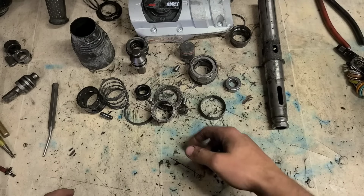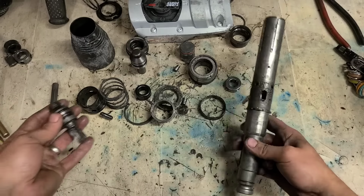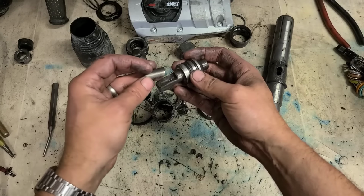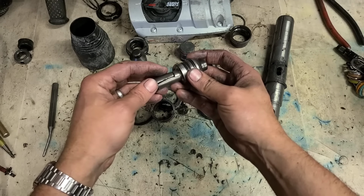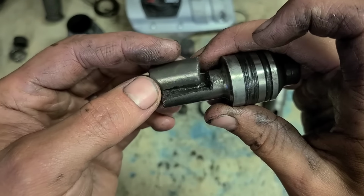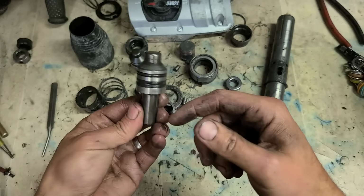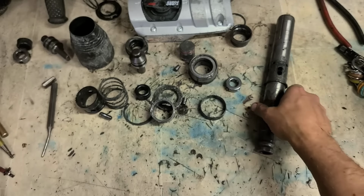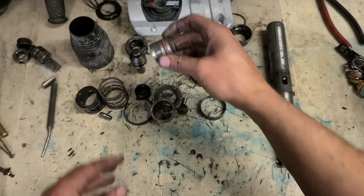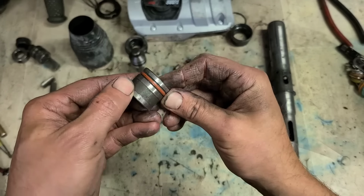Now, before we do anything else, I'm going to wash these parts out, because obviously if this broke inside of here, these hardened steel parts will have been beaten off each other and have chopped away. See, there's wee cracks and bits missing. So these little pieces will have went somewhere, more than likely inside the hammer pipe and on all these components, like the O-rings.